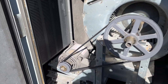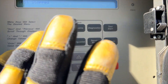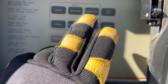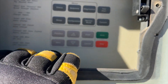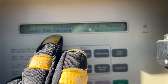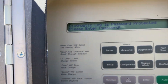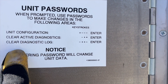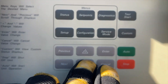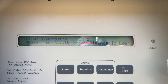Got it all hooked back up. Going to close this off, put it back in auto, and go see if we can find our VAV. Now that all the panels are put back together, we need to clear the diagnostic log. Hit diagnostics - no active diagnostic - hit next, there's our log. Hit the cancel button, it asks for a password. Usually they have the passwords right here. Clear diagnostic log is minus, plus, plus, minus - enter - and now it's clearing.